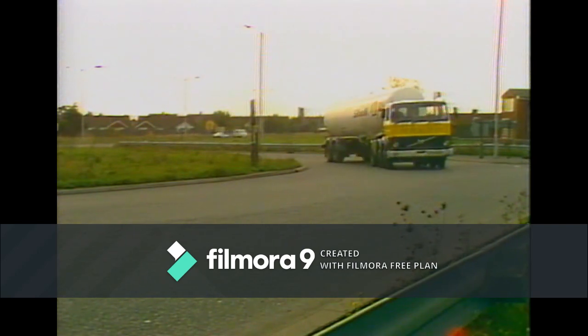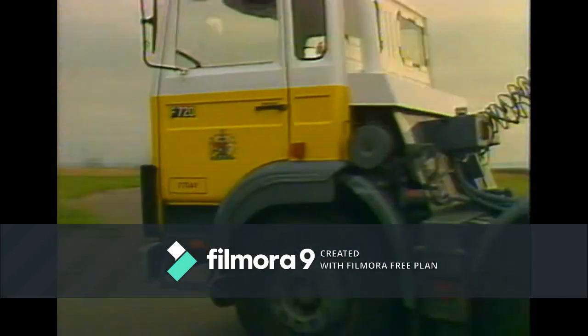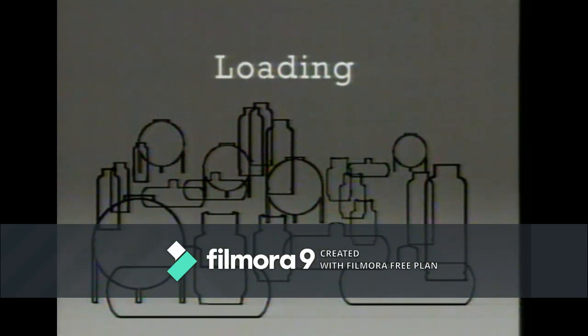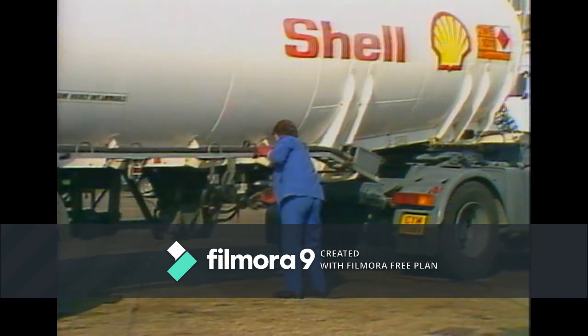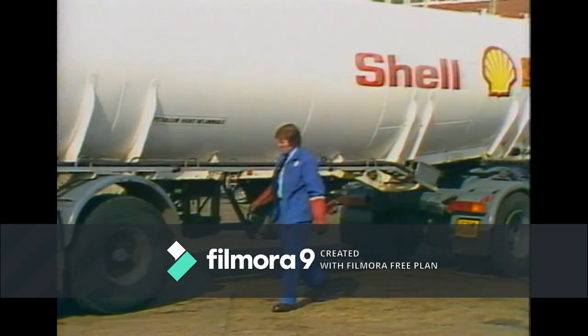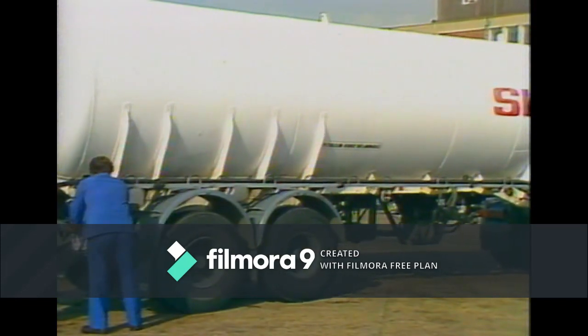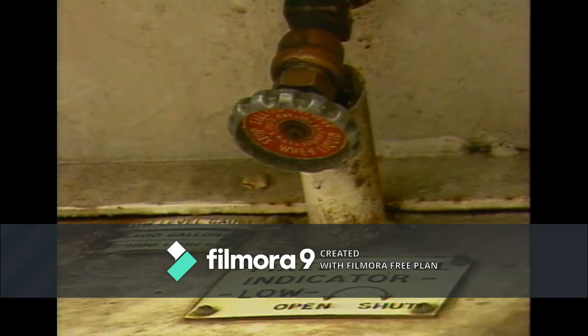Now, let us consider in more detail the correct procedures associated with vehicle operation. First, loading. At the beginning of each shift, drivers should inspect the vehicle to make sure it is roadworthy. Vehicles may be loaded by weight, in which case they must go on a weighbridge before and after filling. Alternatively, loading may be by capacity, in which case the fixed ullage gauge is used to show when the tank is full.